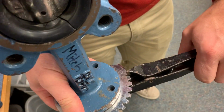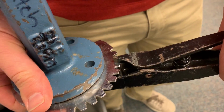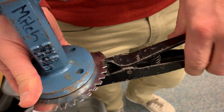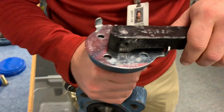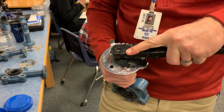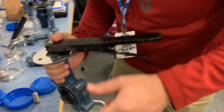The releasing lever locks into this. When I pull it down like this, it unlocks and it moves between segments. So this would be 5 to 10 degrees open, 20 degrees open, 30 degrees open, or all the way back to closed. We have to figure out where that works in relationship. The other thing that keeps the handle on here from slipping off is a 15 millimeter M8 metric bolt.